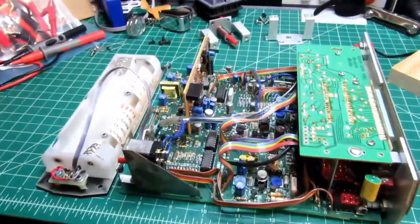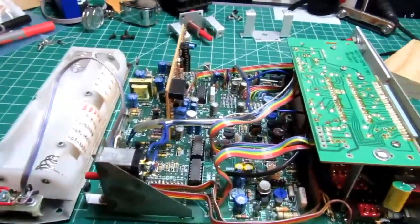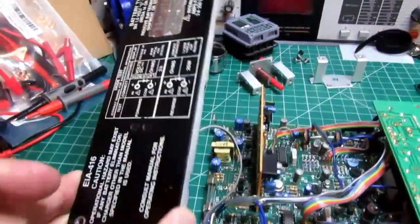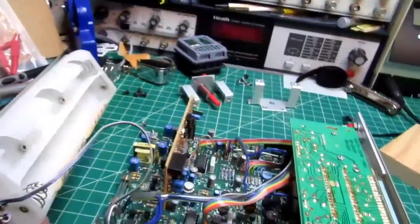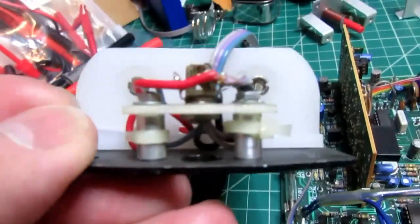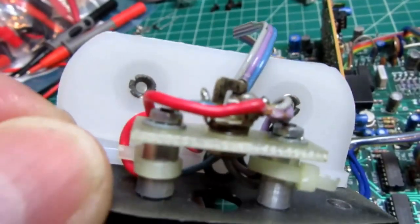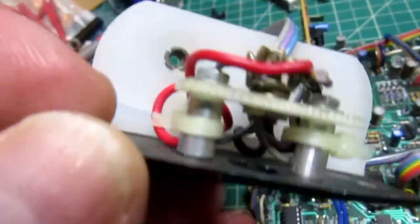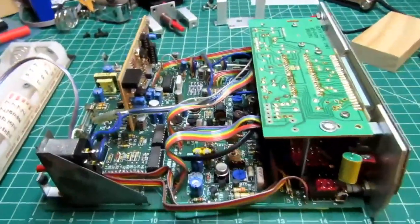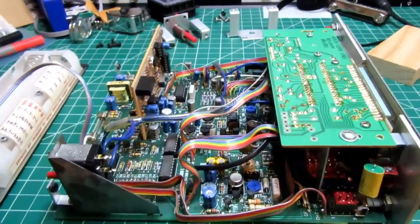Here's the internal view of the IM-2264, looking at it from the left side. Here's the battery holder mounted on the rear panel. It has a small sub-circuit board — really just circuit board material on a couple of standoffs — used to hold the AC power adapter jack, but there are no traces or actual circuitry on this board. The IM-2264 is essentially an IM-2262.